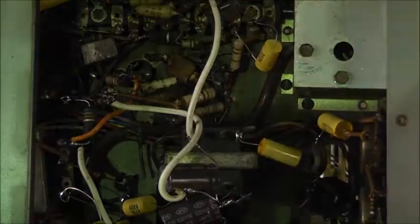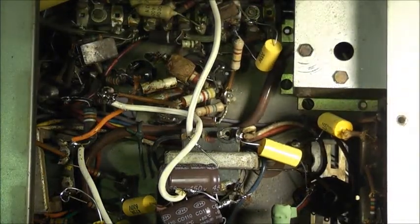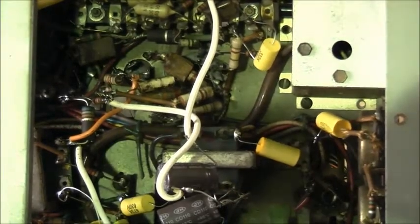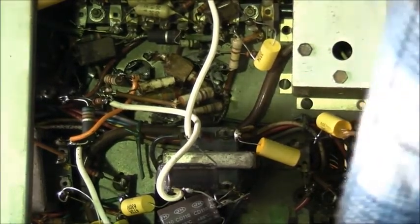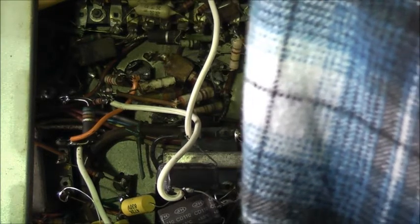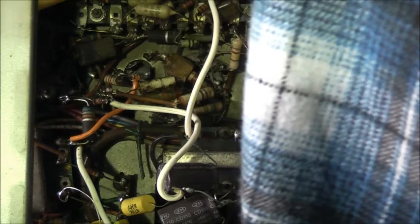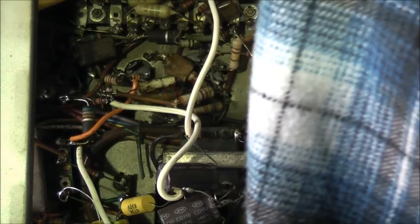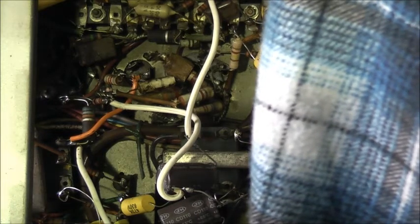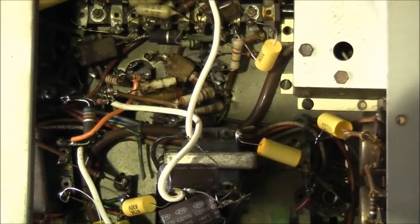The light's nice and bright now. So we've got pin 8, I'll get the little screwdriver. See if that's the actual pin I'm talking about here. Look at the schematic up here and double check that. 8 goes to ground and 2.7k resistor. And goes somewhere to... let me get a good close look at that here.